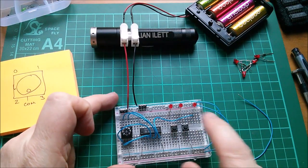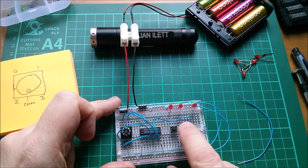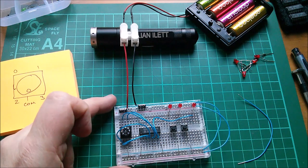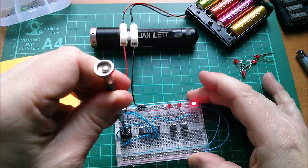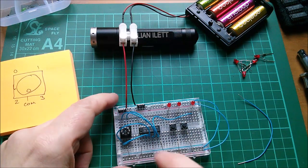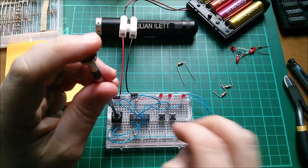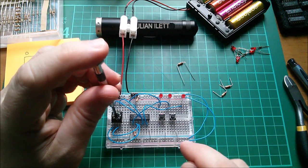I've put three LEDs up here and I've got two input switches — when I press them the LEDs come on because I'm providing a feed to VCC. My output is there. It currently works if I switch between zero and F but it's only half built. I need a couple of pull-downs on the two select inputs and then wire them to these switches. I ended up using 1k resistors — 10k just didn't seem to pull down enough.